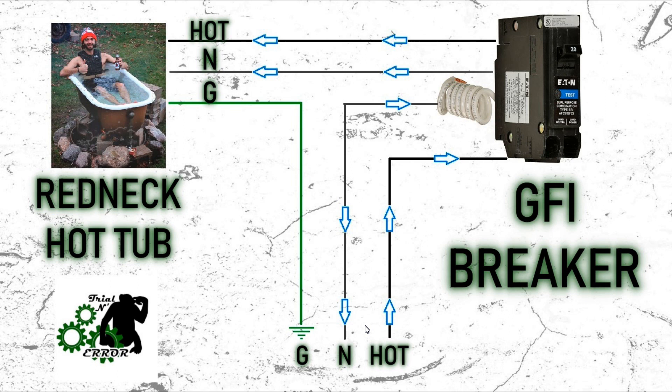So let's look at how a GFI breaker addresses the protection of those circuits. Here's the GFI breaker and I drew up a basic schematic. Just like any normal breaker, you have a hot lead coming in — this particular one's a 20-amp circuit, so it will blow when the load goes over 20 amps. It also has this little coiled-up lead that takes the neutral feed from your panel into the breaker as well. The output is your typical hot going into the device, and the return from the neutral also feeds back through this breaker. Inside is a simple circuit that monitors the amount of current coming out as well as the current returning on the neutral.